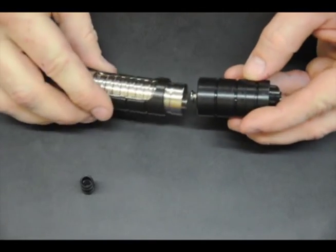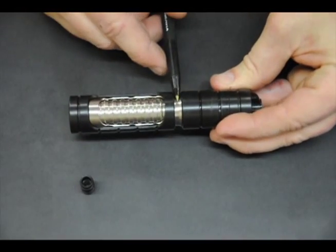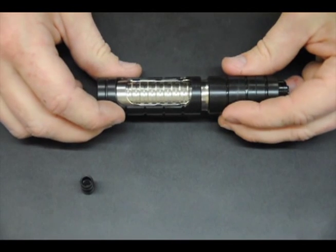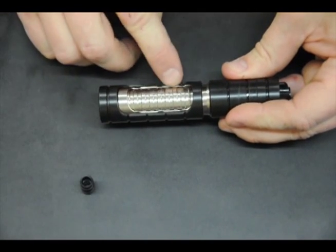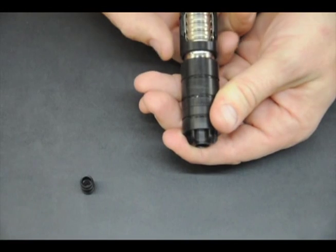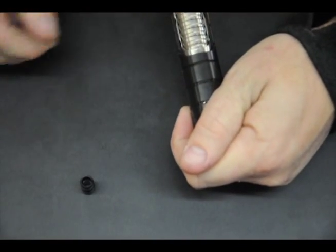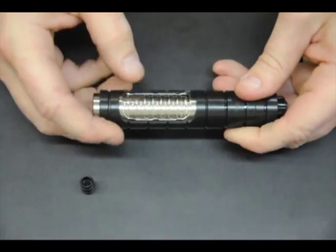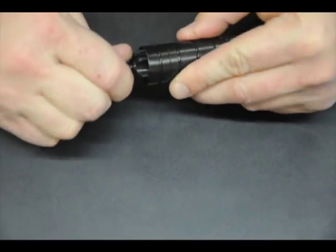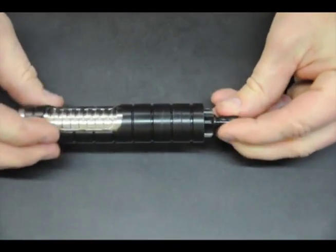Now we've got the upper part together. We can thread on the main body. Once again we have the gap that we intentionally left because we only pushed the lower Delrin sleeve flush with the bottom. Just as before, staying conscious of the cutouts being aligned, I don't want to torque this on as I push the lower Delrin sleeve up and close this gap — I want to provide a straight force. And now you'll notice that the cutouts are aligned. Last, we have the mouthpiece — I intentionally designed that to be a tight fit because I hate it when mouthpieces fall out of things.